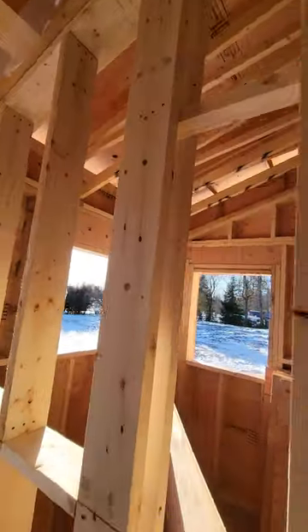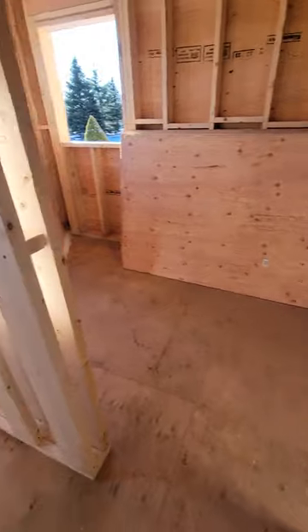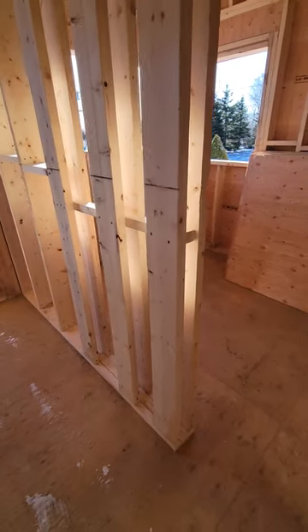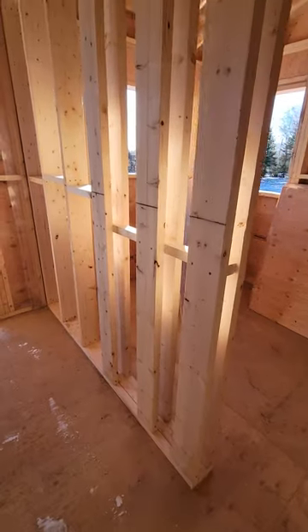Make sure your little header goes all the way back to the back of the door and give yourself enough room for the full width — from the door opening right to the back of the door. Don't forget you'll have a jamb on here as well, so you might have a three-quarter or an inch and a half jamb on there, so you've got that space to account for too.